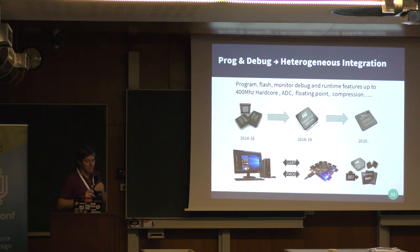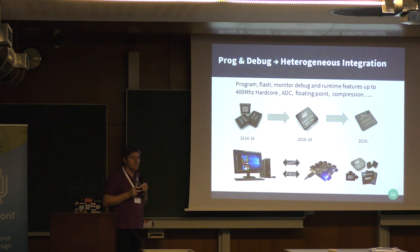A quick word on what we put on the board: there's an STM32 — an F7 on the Ice Core board. Originally this started as an FTDI tax avoidance scheme. Everyone tends to use FTDI chips as an easy way of programming over JTAG or SPI, but they're actually fairly expensive chips for what they do, and they tie you into their host-side libraries. So we went the microcontroller route and used STM32s throughout, starting with the STM32F103 M3, and now doing F7s and H7.